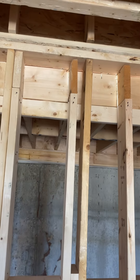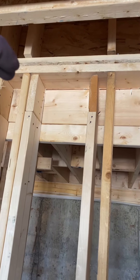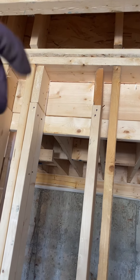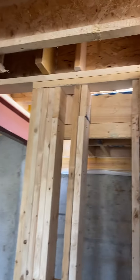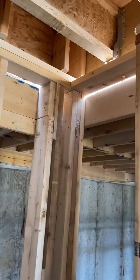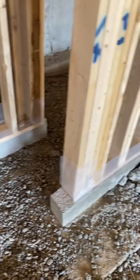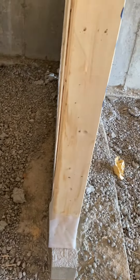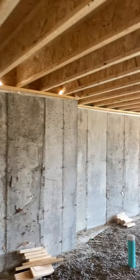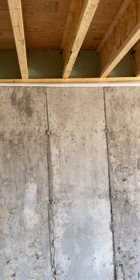That's just there temporarily. This is kind of nice because it is fifteen inches down. So the way the floor is with the eleven and seven-eighths and the three — fifteen inches down works perfectly just underneath the second top plate. Another wall here, first in the jug, same idea — just center blocks, poly wrapped all the way around. I put two layers of poly on these walls, go half and half, that way it gives a better wrap. This wall here is fire break, same with this wall, because it's a two by six sill — it's not an issue when it comes to bearing.